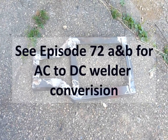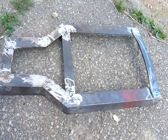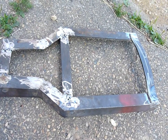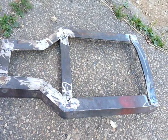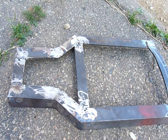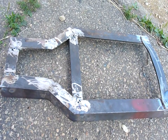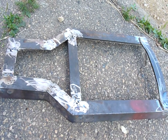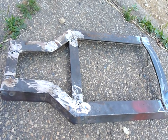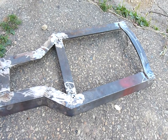With the welder, you have to keep an eye on the duty cycle. It's a little more prone to overheating now that it has diodes in there — before it was just a transformer and could handle more current. Semiconductors get hot when a lot of current passes through them. Working at around a 20% duty cycle, I noticed warm air coming out of the arc welder cabinet — not hot, but warm. If you get up to about 50%, the diodes would definitely be getting hot, and when diodes get hot, they tend to short, which is the last thing you want.